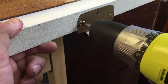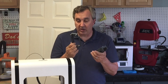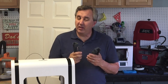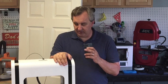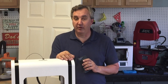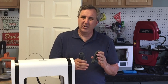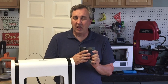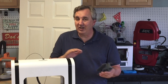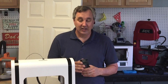I'm really happy with the way this turned out — this is going to be a tool I keep in my toolbox. The Matterhackers PLA filament worked really well. I printed two of these brackets on the Robo3D — one with a raft and one without. I'm glad I printed with a raft because I was having a hard time getting things to stick to this bed. They recommend hairspray and include a glue stick — I tried the glue stick first and will probably try hairspray next. The raft came out beautiful but was hard to peel off. The raft in MatterControl just doesn't peel as well as Simplify3D. I did try Simplify3D but the auto bed leveling didn't agree with my settings, so I couldn't get a consistent good print to stick.